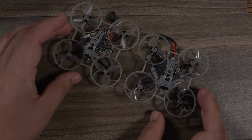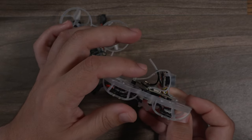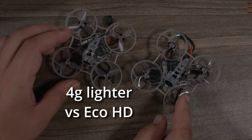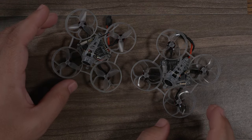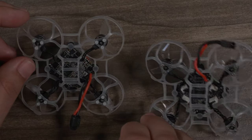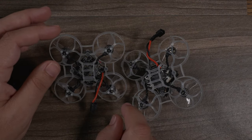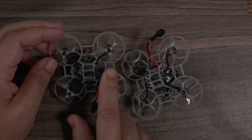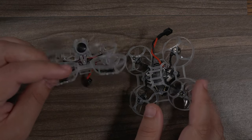If you thought it looks a lot like the recent ECO release, you are correct. But notice right away — the ECO release is two layers tall because the video transmitter is its own separate board above. This new all-in-one is going to save you just over four grams of weight. They're going with a lot of weight-saving choices: the new HQ prop, moving away from the Gem Fan used prior, a very thin dipole without the metal piece that adds weight. At the bottom they've transitioned to plastic screws, which save a tiny bit of weight.